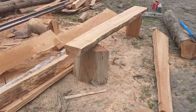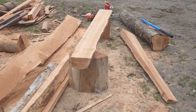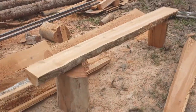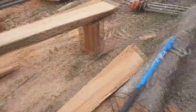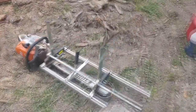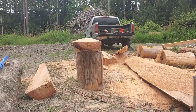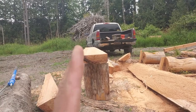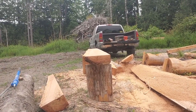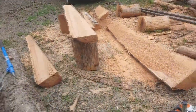I've picked out what I think we can get some boards from. I've got them all bucked down to about nine feet, figuring we can get eight-foot boards out of them in varying widths. I've got my mill adjusted down to one inch, so the rails are going to ride on the nice flat top we've made and we'll just cut out one-inch slabs. Then we'll trim the ends when we need to turn them into dimensional boards on a table saw.